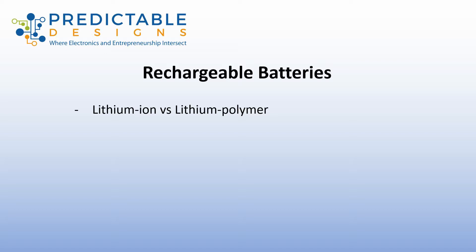These two types of batteries are fundamentally very similar. The key difference is that a lithium polymer has a little more flexibility in the shape of the battery and they can be made thinner. So for really thin small products where you need an odd shaped battery to efficiently use all the available space in your product, then a lithium polymer is going to be a better choice.